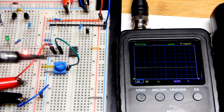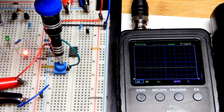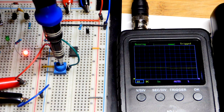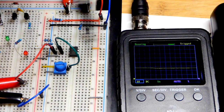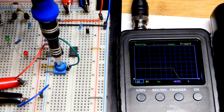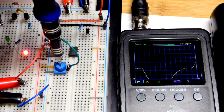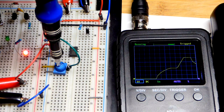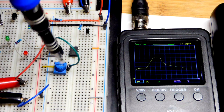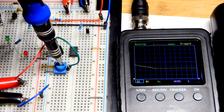In this video we're going to look at adding hysteresis to an op-amp comparator circuit. I set a voltage and you can already see a problem - the light is flickering, it's indecisive right at this voltage. Going to the negative rail at five volts, it stays off until about 2.5 volts, then the LED comes on. We set the voltage to 2.5 volts with the inverting input; if the non-inverting input goes below that the output is low, above that it's high.